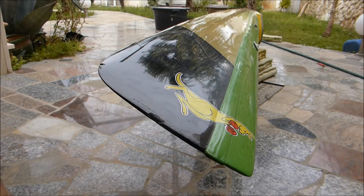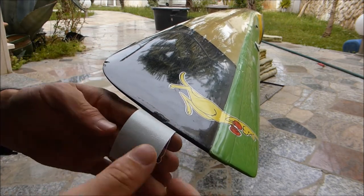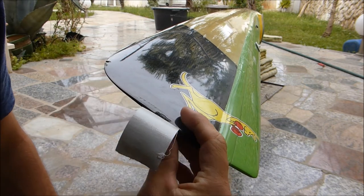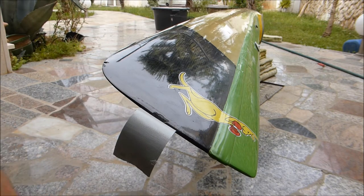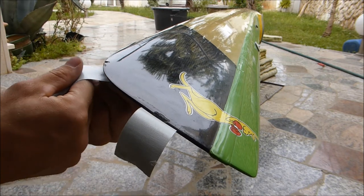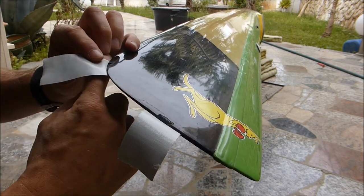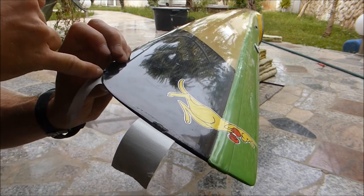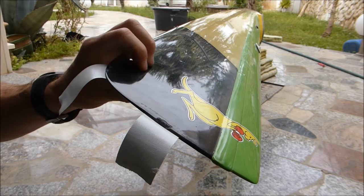The first thing we're going to do is tape up one side like so, and we're just going to edge it up a little bit to create a little bit of a lip in here. We'll do the same with the other one. You want to make sure that the base is perfectly sealed. If you have little kinks in the tape the glue is going to run out along the tape and then you'll have a nice little vein of glue running out here which you'll have to sand off, which just takes time.